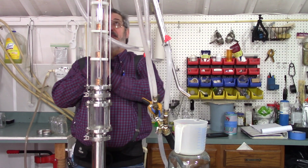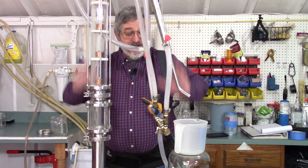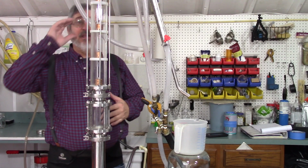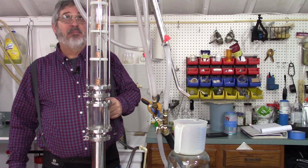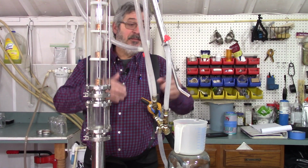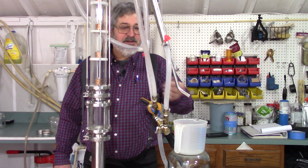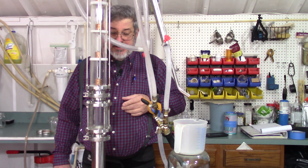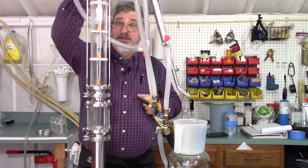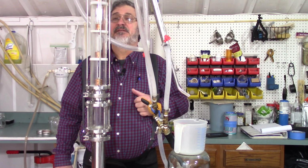So, like I've said in the past, now is not the time to walk away, because she's getting ready to really start producing. You've got to be here ready to turn the heat down a little bit. So we're real close. The one thing I want to mention is that I do have the water turned off to the pre-condensing unit there. I do have the water on the condenser, so I'm going to let them vapors come up, and I'm going to collect off the first, I don't know, 4, 5, 6 ounces. I'll keep a smell on it and a feel of it and a taste of it. Then once we get the first, let's say, 4 ounces, we'll turn on the pre-condenser and start to load up the plates in that column.